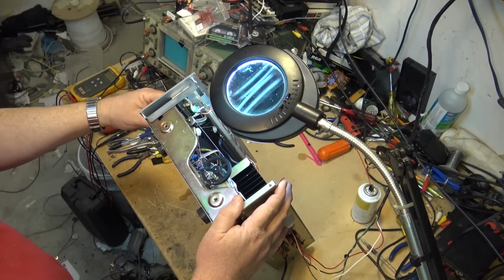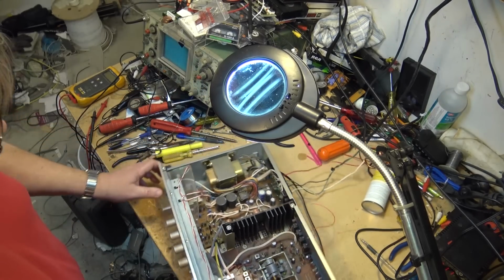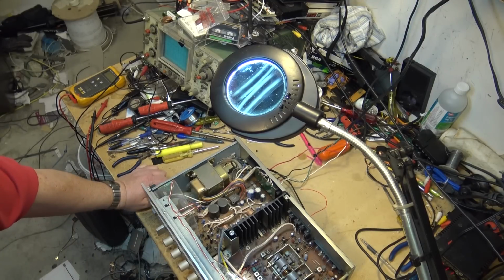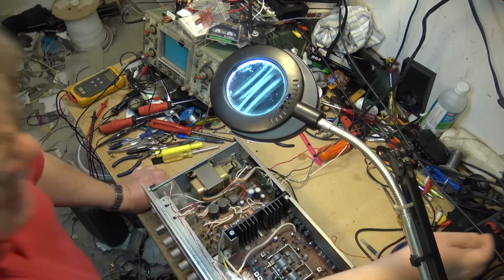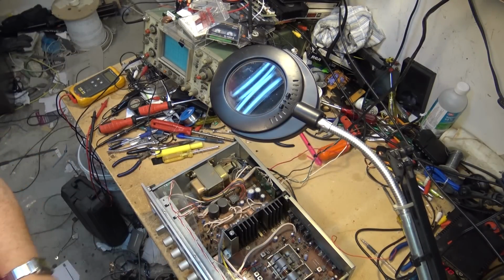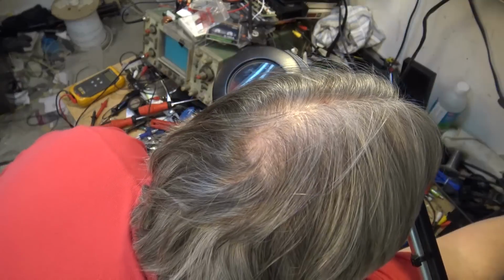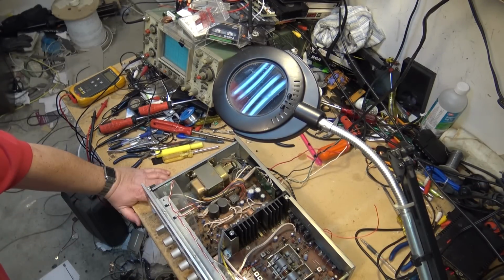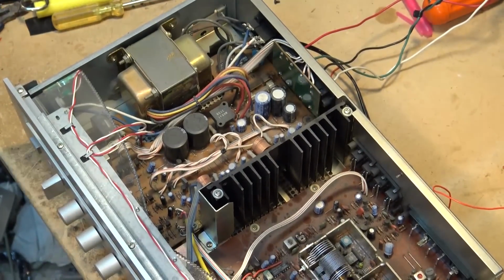That's noisy. That's what these $10 special FM transmitters get you. Lots of noise. I bet you that noise is coming from my lights in here. Listen to this, I bet you it's that light. Yeah, that's all it is, the fluorescent light in here. I turn it on. My desktop causes interference. But my problem with the noisy controls is gone.